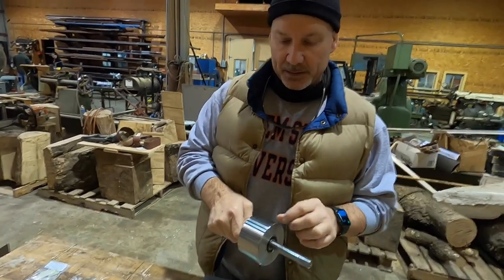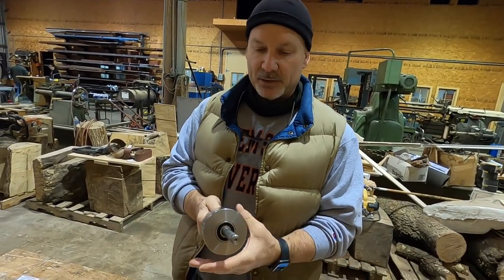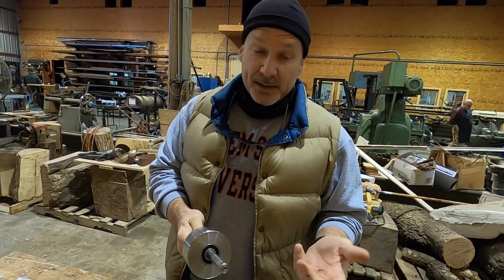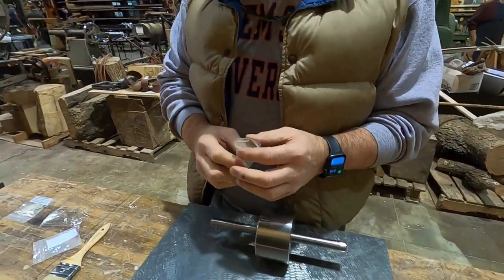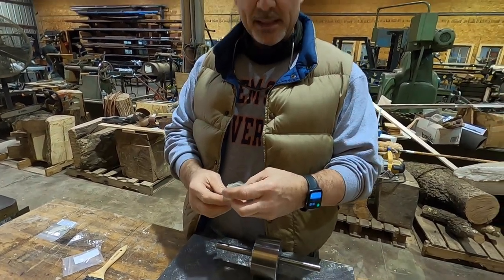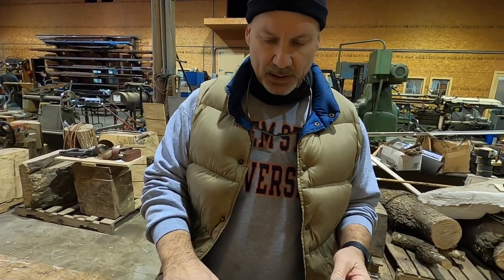We were actually able to get some spots on here that were 64 Rockwell C, which was pretty surprising, because that's almost like an as-quenched number. But anyway, all this is like a diamond bread roller. We're just using it to embed diamond particles into these cast iron laps. If anybody's watched Robin Renzetti's show, he's got one somewhat similar to this.